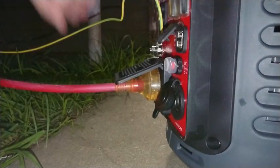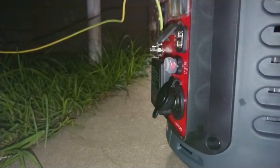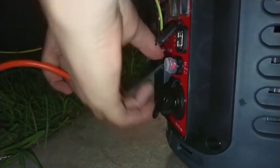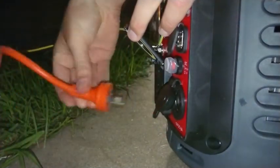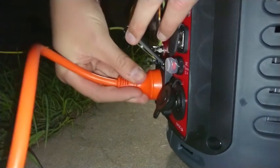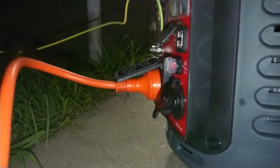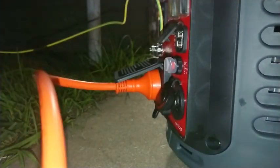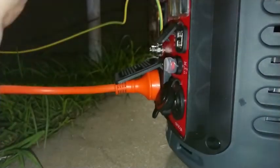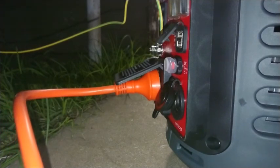It's night time now. We're going to plug in our RCD and then go up to the other end and see if our trip-time tester will actually trip the unit. While the unit has a test button on it, I don't think I'd be able to certify it as AS/NZS 3760 compliant if I didn't actually plug it into a cable and test it from the other end. Let's fire this up and try it out.